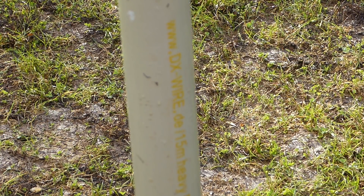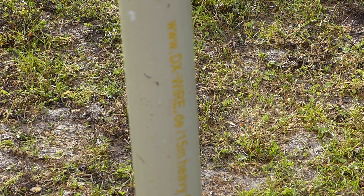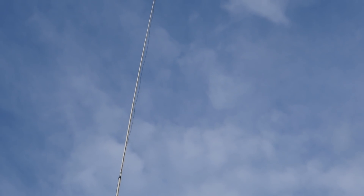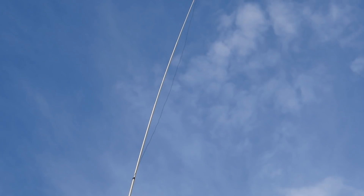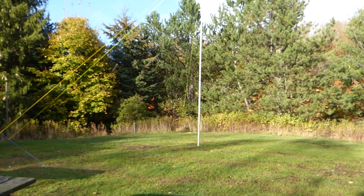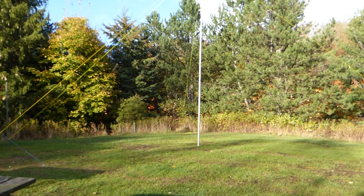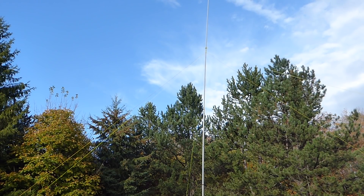A quick note on running the antenna wire straight down the pole: the fact that the pole is made of fiberglass means it will not detune an antenna the way a metal pole would. I've zoomed in on the top of the mast. You can see I have taped the far end of the end-fed antenna to the tip. In addition, as the wire comes down the pole, in various sections I have used electrical tape to fasten the wire to the pole and keep it from flying around. I am using five guy lines and good quality camping stakes to have them deep into the ground. I am hopeful that this setup will stand up fine in some of the strong breezes that we've had. I've had this up for about an hour now, and so far so good. Well there it is — a thing of beauty. I always find myself wanting to salute a new antenna once it's been raised.